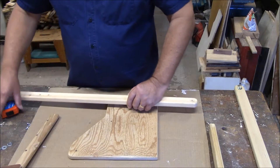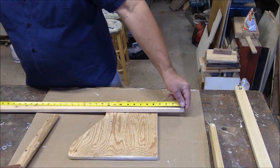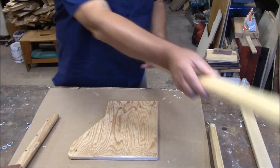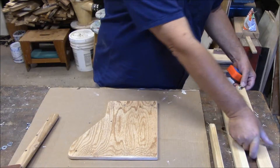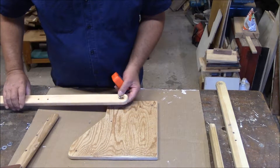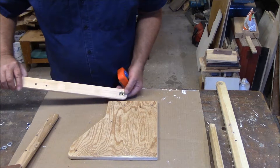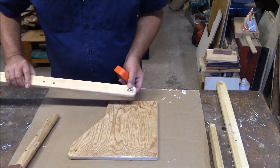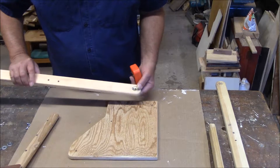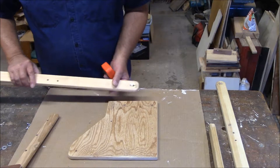This is the upper arm, and the upper arm is thirty-nine inches. You'll notice I've got my anti-spin bolt clips that I made — just a washer that you bend up. You measure the head of the bolt into the hole, bend it at a ninety-degree angle in the vise, drill a hole in it, and put a small screw in it — about a half inch long.